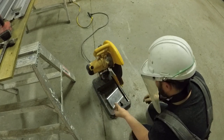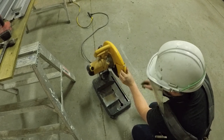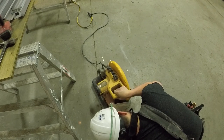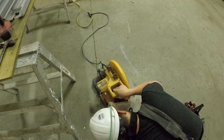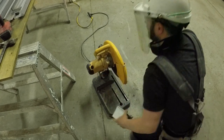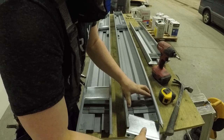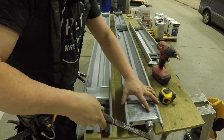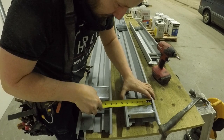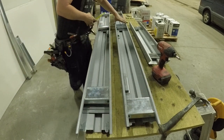There's a piece of metal in the door frame that is prohibiting me from closing it to 4 7/8. So here I'm just shortening it a little bit. And do this in small stages, right? If you got to check a few times, no problem. I was lucky here. I got it right in the first try, because I knew it was just a little bit anyway. So there you go. I'm going to verify it. Boom. 4 7/8. It's mint. So everything's mint. I'm going to go and check. Everything is going to be mint, right?